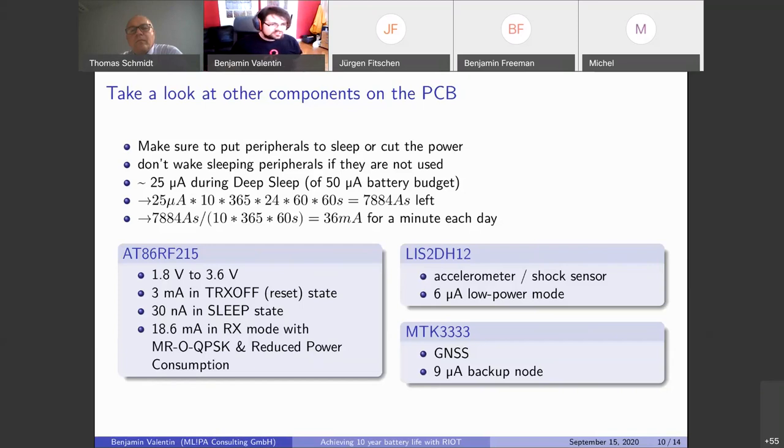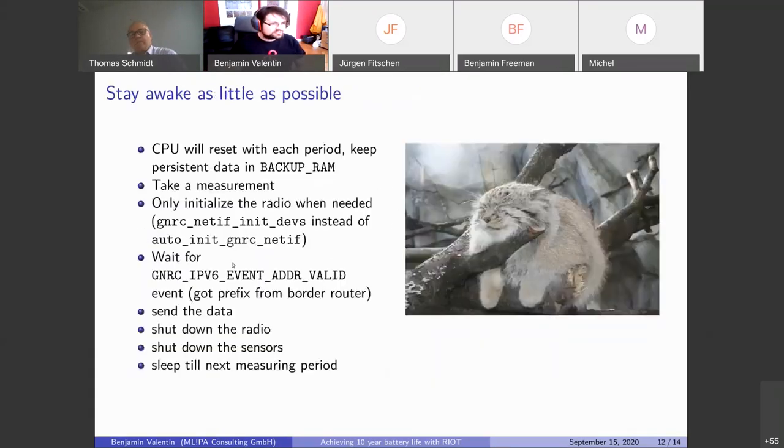I mean, there are helper macros, right? There is this backup RAM attribute that you can just attach to a data structure, and then it will be placed in backup RAM. That's already in place for the different platforms, right? Yes. Okay. So, do you see a benefit to add something like for RTCs, for example? There's this backup memory, to have that somehow unified.